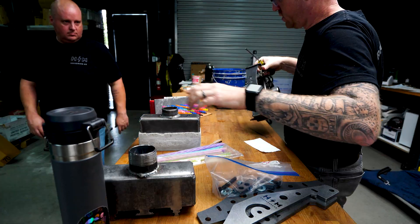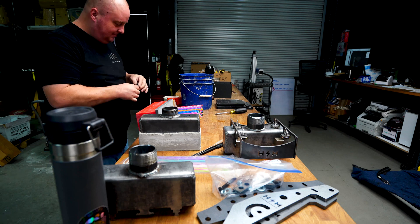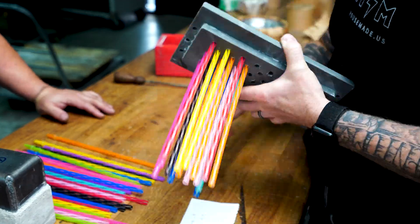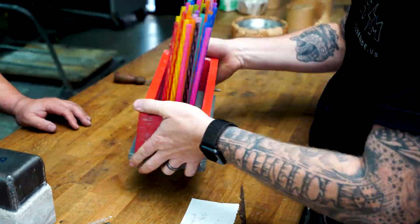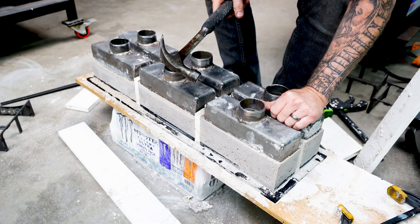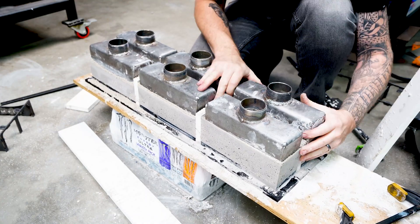I'll start off with the ribbon burners. The ribbon burner project has been one of those things where I now realize why they're not mass produced — they're really difficult to make on a larger scale. There's a lot of little details that if you don't pay attention to, the burner just will not work right. I did all the math and calculations initially for airflow, water column, air-fuel mixtures, and then developed a system only to find out it was really hard to use that system to make even six at a time. I developed that funnel system to pour the refractory, and there have been numerous challenges, but that's what I love, so I keep hammering away at them.